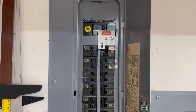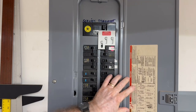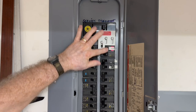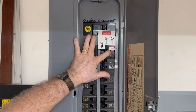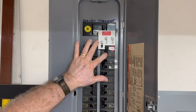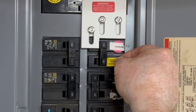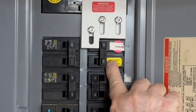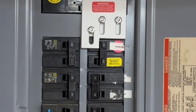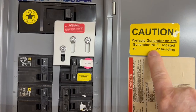Turn your breaker back on and you can test to see how everything works. The interlock is now installed — you'll notice that the generator breaker cannot turn on at all with the main service on. This would have to be turned off first, then you raise this up, and then you can turn the generator on. That is very important to have in place. I have a little sticker that came with the interlock that I'm putting right on there, plus I'm going to leave that original sticker on as well. There's also a caution sticker I'm putting on here that clearly identifies there is a generator on the panel.